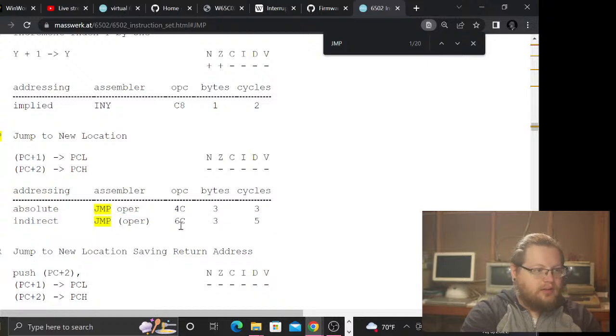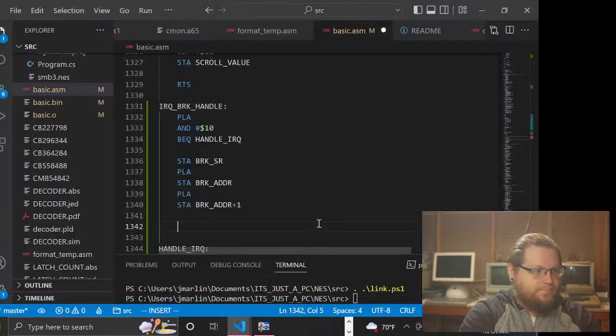Yes, so jump indirect. And that is 3 bytes, always. You can't have a faster zero page one, so we can put that number wherever we want. That's cool. So I guess we'll just have another memory location where we'll need... Oh, I guess we can get the jump table base address just from the assembler. Yeah. Is this reasonable? I don't know.